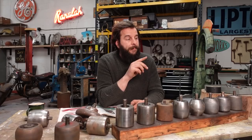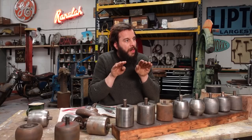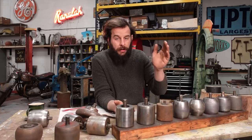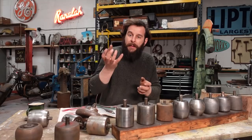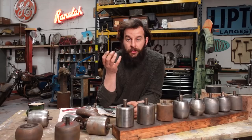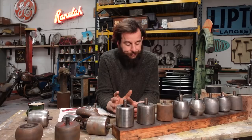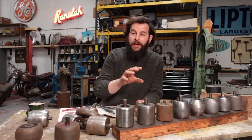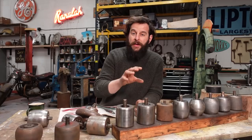Using those measurements I'll make a blank, then fine-tune it on the lathe - maybe just with a little emery paper - to gently round off the corners and soften the flat to make it ever so slightly round by hand. Once I've finished them and Jeff's happy, maybe I'll get them 3D scanned and show that to the guys doing the 3D models of the wheels so they can tweak their models. It's going to be a lot of trial and error, but with the original blueprints and Jeff's knowledge one way or another we'll get there. The three wheels the Ranelagh wheeling machine comes with will be as they were originally, to the drawings, and will work perfectly.